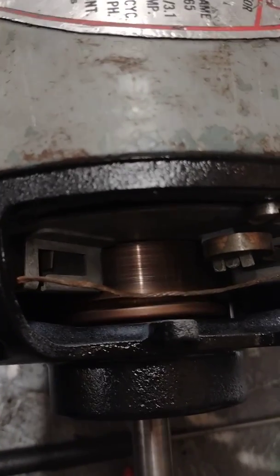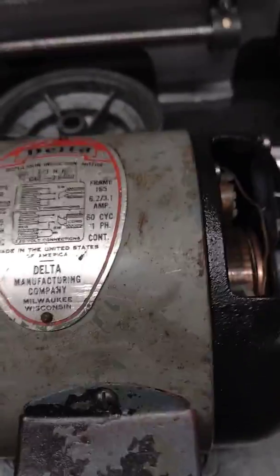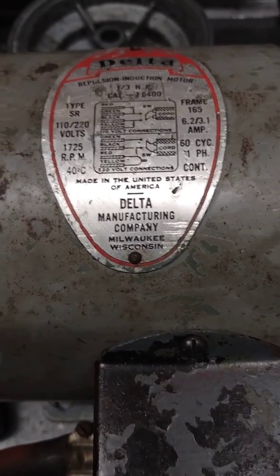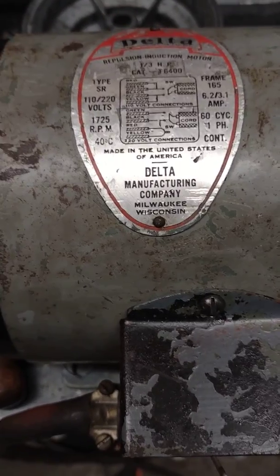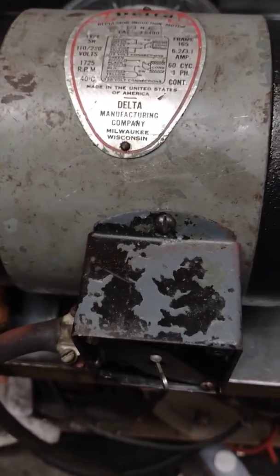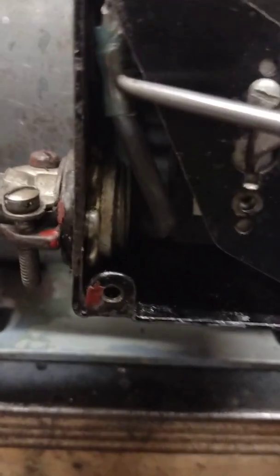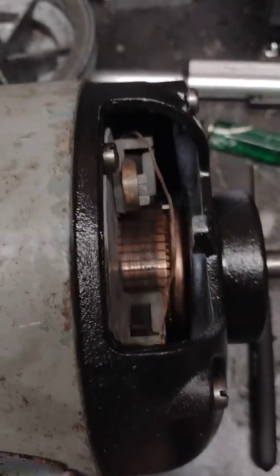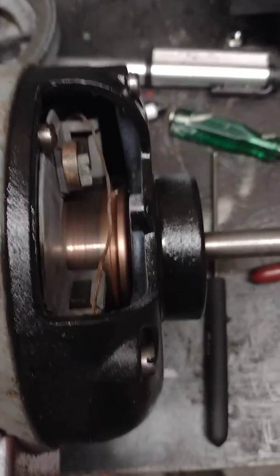That's pretty interesting because I don't normally run into one of these old things. There you are, ladies and gentlemen — I win again, even though I kind of didn't know what I was doing. I try not to let that stop me. Also, while I was putting this back together, I thought it might be a good idea to hook the ground wire up. Whoever the jackass was that put this wiring in stripped that ground wire and left it hanging and flopping in the wind behind that switch — so it was never grounded. Now it is grounded, so it shouldn't zap you in case something happens.